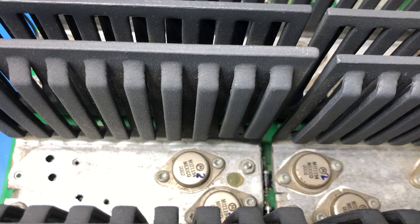So when we're looking at those two 0.4 ohm resistors in parallel, obviously that looks like 0.2 ohm, we're starting to talk about lead resistance kind of values. So just a slight bit more of a complication, but now I've got a better idea what's going on here, I'm happy enough. So I'm going to whack this transistor back in that I've taken out and tested, and I'm going to take the other two out, just check that those look like they're okay, and see where we go from there.